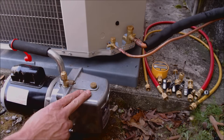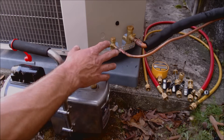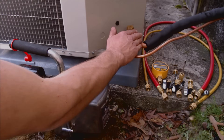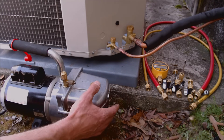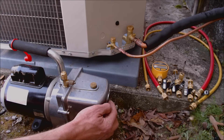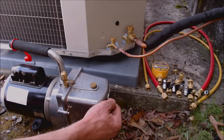We have two ports on our 6 CFM vacuum pump. You could use a 6 CFM or a 3 CFM. This system right here is a residential split system — you have an outdoor condensing unit, about 60 feet of line set, and then an evaporator coil inside the house. Always make sure to change your vacuum pump oil, or you won't be able to draw deep vacuums, and that actually wears the vacuum pump out if you just reuse old oil. That oil definitely has to be changed, especially when you're doing a system that had a compressor burnout or something like that.